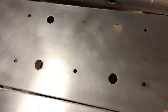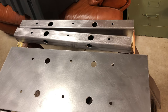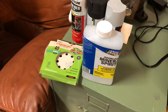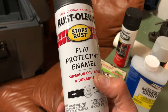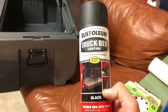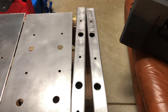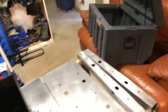You can see where we sanded down the sheet metal to give it a nice clean finish, then we hit it with mineral spirits to clean the surface. We're going to prime it with a flat protective enamel - good old Rustoleum. Rustoleum also has a super cool truck bed coating that I'm going to put on top of the first layer, which will give it good traction. The exterior pieces will match the same texture as the trailer paint.